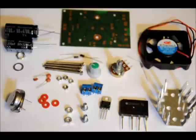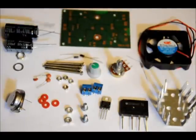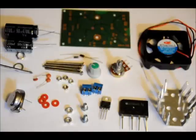The fan is used as an alternate method of heat sinking to keep the LM338 cool under harsh loads. And the custom PCB. When you receive your kit, look for these materials — I've checked every single kit personally. If you can't find some of the parts, look in the fan, because more often than not you'll find that the washer, nut, and little capacitors get stuck in there.